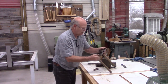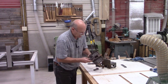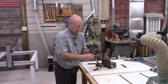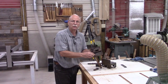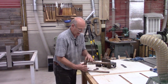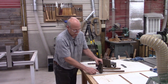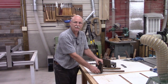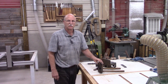There is one other thing I wanted to show you. These rods are held in with a nut — they have taken a punch and punched down in here to keep that nut from backing off. The problem with that is the nut doesn't come off. So rather than mess with it, I just cleaned the rods by hand and I'm going to leave that on there. Instead of punching into the threaded rod and nut, use some Loctite — don't punch in there, you're just damaging the threaded rod.